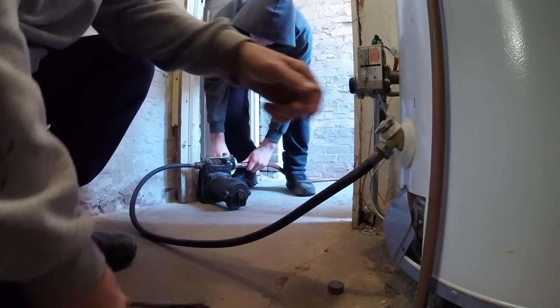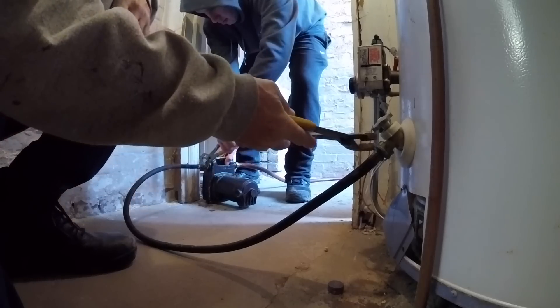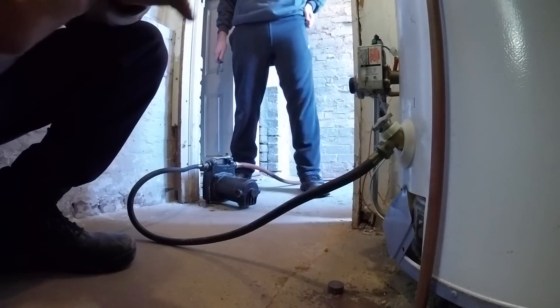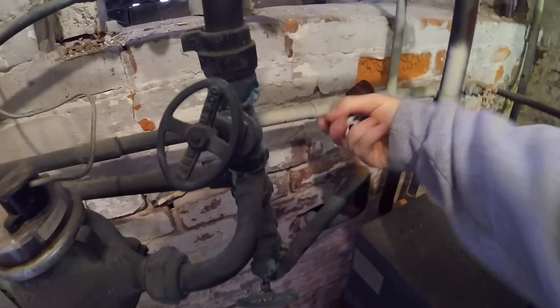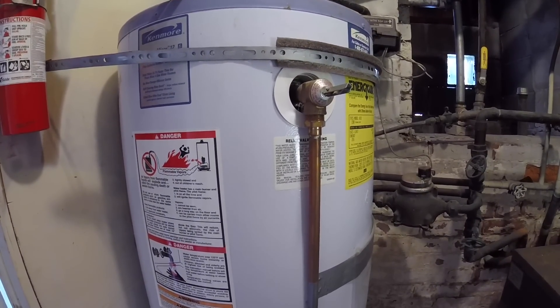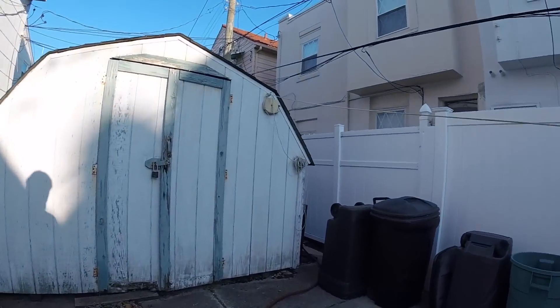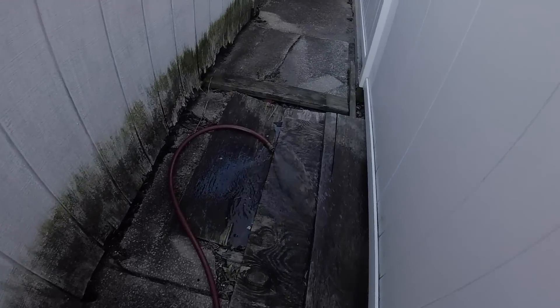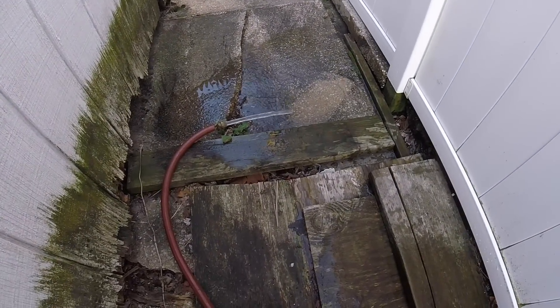CB2 is on scene. We've got plenty of pressure going through the hose and not much sediment. Plug her in CB, then turn the water heater off and open the relief valve to break the vacuum. The water is draining in a safe place, out of harm's way — no rust stains, out of sight out of mind. A little broken concrete area is perfect.